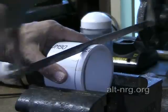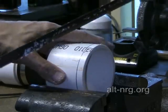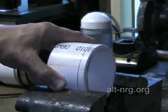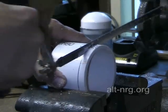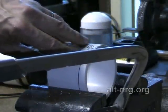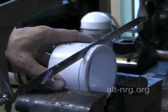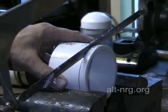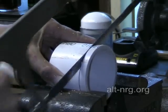That looks pretty good. I can already feel the blade starting to go through the pipe, so I'm in good shape here. I'm going to start spinning the pipe around a little bit — this gets easier as you get further down through the pipe. My blade is only cutting through the part of the line that I can see; I'm no longer cutting through the far end of the pipe. I know where the far end is just by rocking the blade back and forth, so I back it up a little bit and start cutting. This allows me to guide the blade along the edge of the line all the way around.